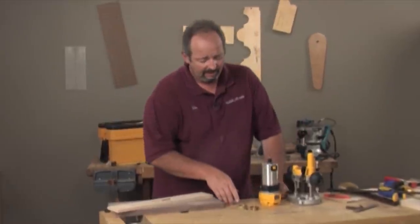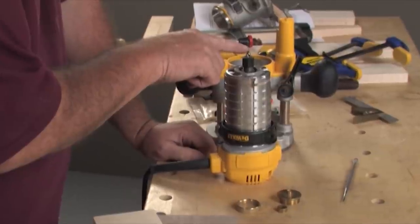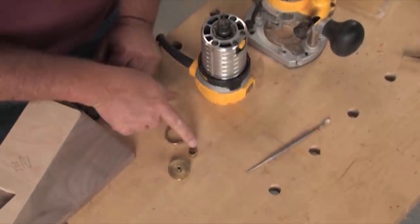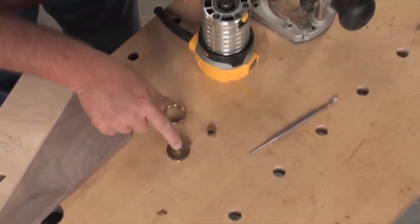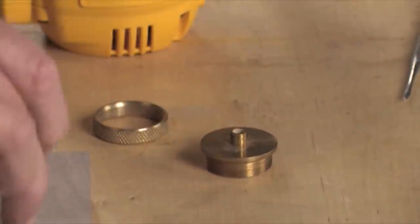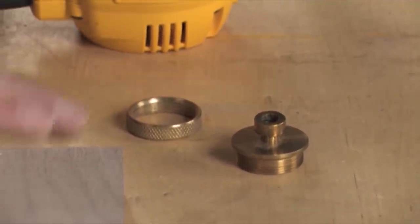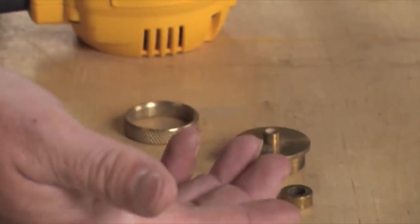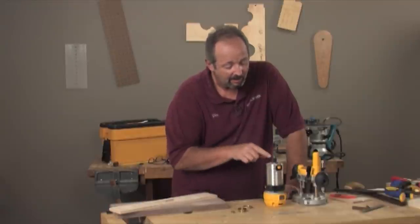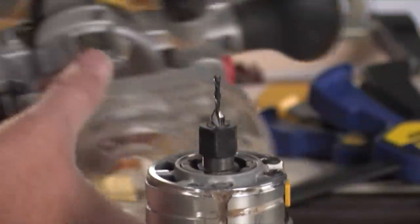What it involves is three pieces that come in the kit. First is an eighth-inch spiral upcut router bit, and down here we have a bushing that not only has the opening, but also has a bearing or bushing that goes around that piece. The way it works is the first cut you make into your work surface has these two combined. Then when you start working on the piece you're going to inlay, you take the outside piece off. That's how they come away with the size differential based on the eighth-inch router bit — that's why it's important to have the eighth-inch router bit along with the inlay kit.